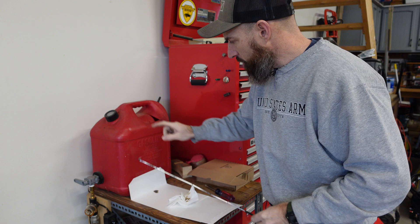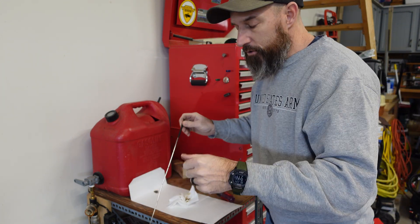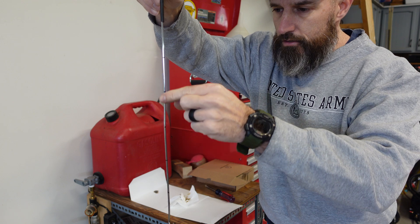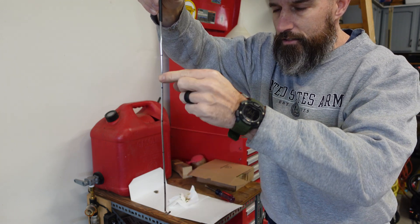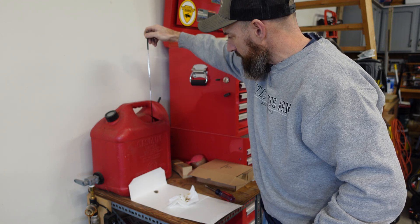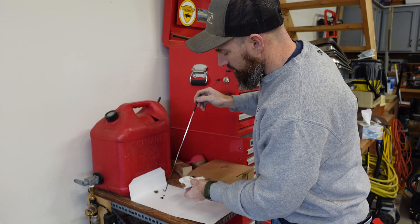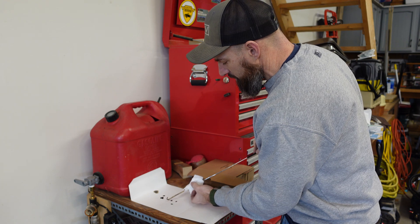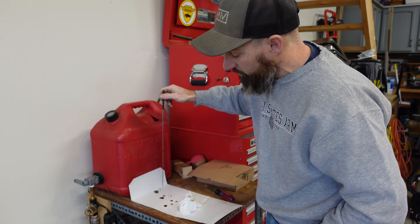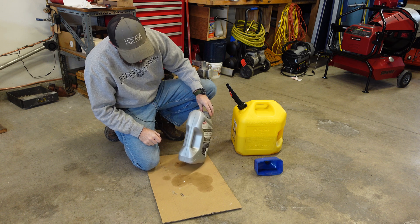Let me measure and see how much oil I have in my tank. If you've seen my other videos on this used oil burner, I made this little stick with marks — every mark is one gallon — so I can just stick it down in there. It looks like I'm up to my two gallon mark. I'm going to try putting one quart of diesel to two gallons of oil, and if I don't like that I'll just add a little more oil. I've got at least a couple gallons of diesel here so let me just pour it in.